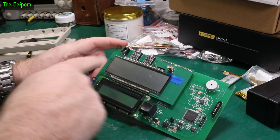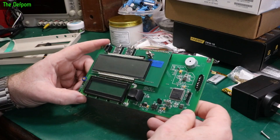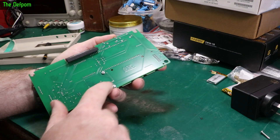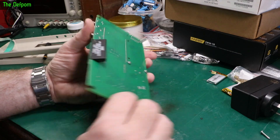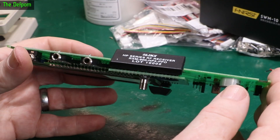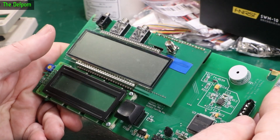The buzzers have moved from here to here. The display section is the same, the voltage regulator is down here, and the power connector is down here. One side is ground which comes right round — it's not a flooded plane. This is the IF module — interesting device. That's what I've seen in some of the early units as well, something similar to it.